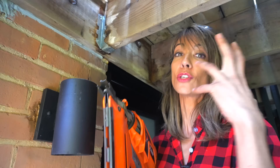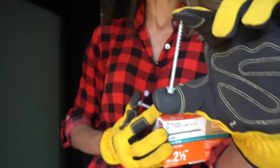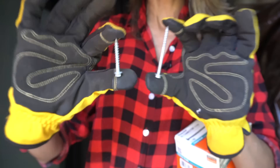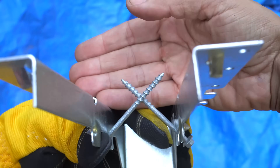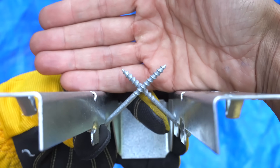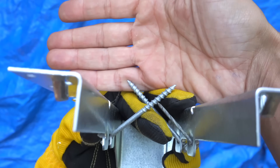Professionals are using nail guns — they're heavy and they're expensive. I actually like to use screws instead, and that is what I'm using today. This is a two-and-a-half-inch screw — that's what we're using for double shear nailing. The other one is an inch and a half, so that's a big difference. When do we use inch-and-a-half screws versus two-and-a-half? This is what we call double shear nailing: your joist sits here, your ledger is here, and X marks the spot — two points of connection between your joist and your rim joist. This makes your installation extra strong, which is why you need those extra-long screws. A lot of people use an inch and a half, but it's not going to go remotely into your ledger or rim joist.